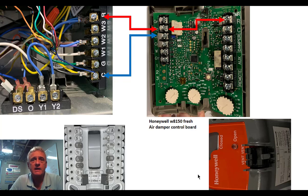We've got a connection here from common — self-explanatory — come from the air handler transformer and bring it over to either one of the common terminals. On the fresh air board, see where it says CC and CH, and there's a jumper between the two? You could have a common for cool and a common for heat if you wanted to go that route, but you don't need to. You can leave that jumper in and just bring common over and put it under either of those C screws on the left-hand side, because the jumper connects both of them.